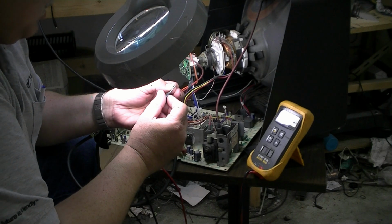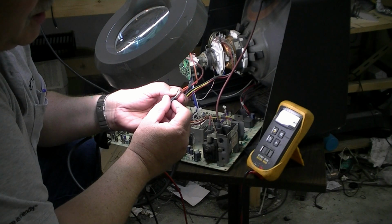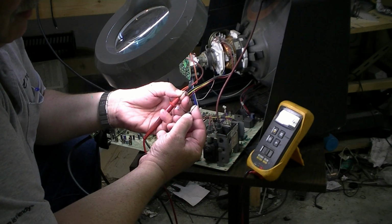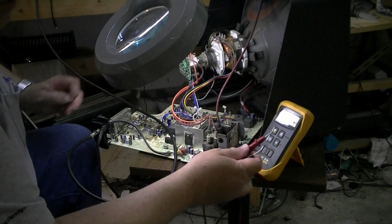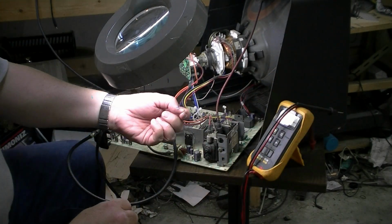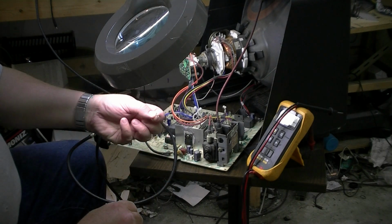Yeah, this resistor is shot. Oh, it's actually measuring open. That was my skin resistance. You can see that. My skin is kind of relatively low resistance today. It's hot out and I've been sweating. So yeah, my skin resistance is a little low. This resistor is foobar. So I go to my resistor cabinet and we'll find another one.